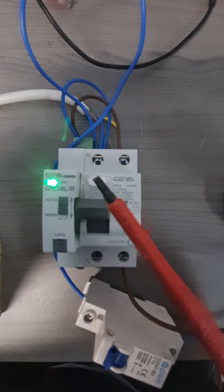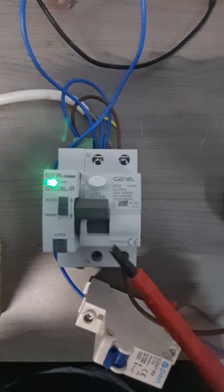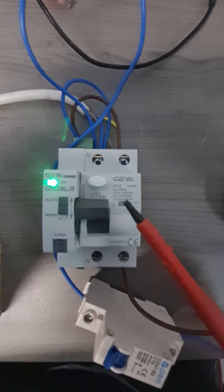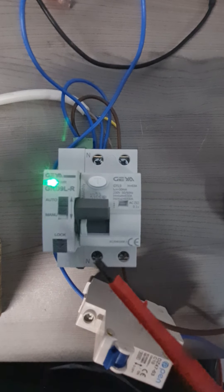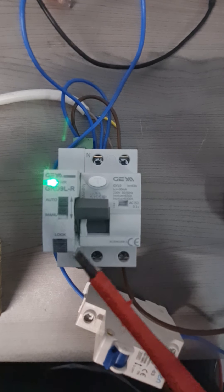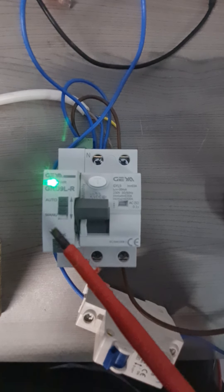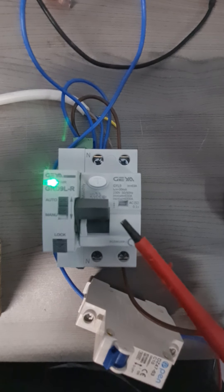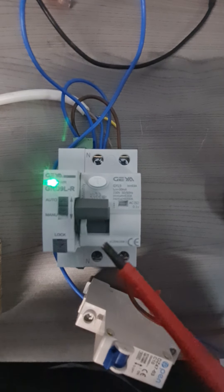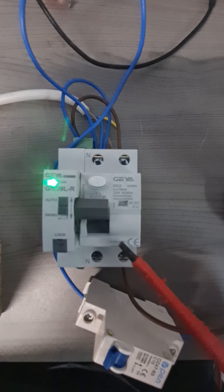What is most interesting about these units is how the reclosing operation is carried out. From the datasheet for this particular unit it seems that there is no feedback from the output into the auto reclosing unit. Basically, from what we have understood before testing, this is just an auto reclosing unit with timers and delays, and it has no particular information about the leakage current in the system.